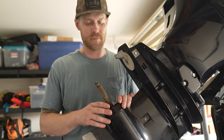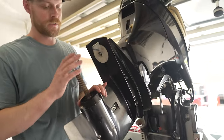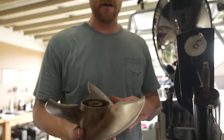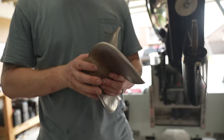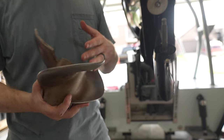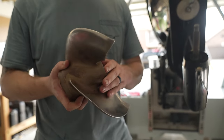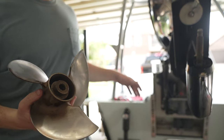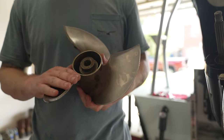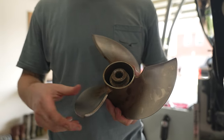This kind of visual inspection is something you should be doing every six months. While doing your visual inspection of the shaft, go ahead and do a visual inspection of your propeller as well. Check for any chips, cracks, wear, tear, and any kind of corrosion buildup. Keep in mind that over time, especially if you're running a skiff in shallow water, you are going to wear down your propeller blades and may need to replace the propeller due to wear and tear.